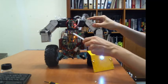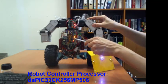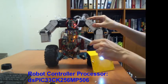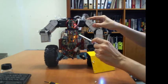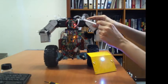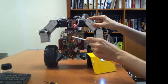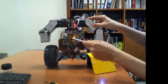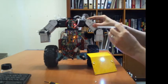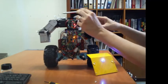In the middle we can see the custom-designed robotic controller board. The heart of this controller is a DSPIC33C microcontroller from Microchip Technology, running at 200 megahertz. The top circuit board is a custom-designed smart servo shield that captures the full-duplex serial data from the robotic controller and converts it into half-duplex format, which is then sent to the individual smart servos.